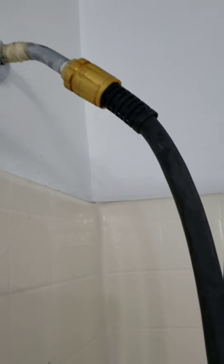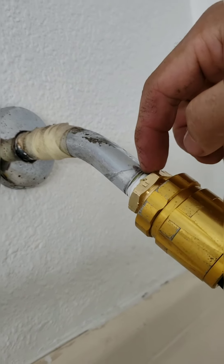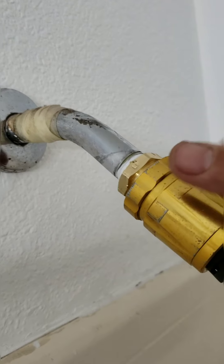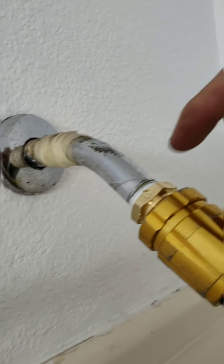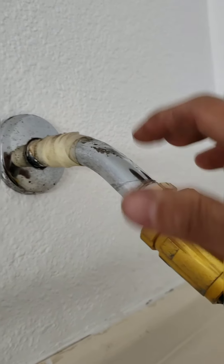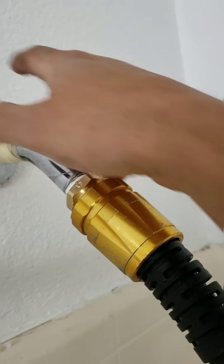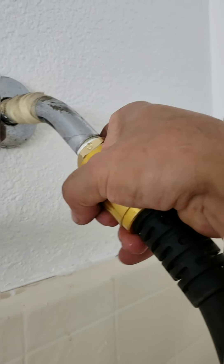This is option number two. You could put this inlet, which is a 1/2 inch female with 3/4 garden hose male — they sell that at any hardware store. If you don't want to have the diverter permanently installed, you could just put this instead. If you're like me and bathe the dogs only a few times a year and have no problem putting this on and taking it off, great. Just be very careful when tightening — hold the pipe for support, because the last thing you want to do is break the copper tubing or galvanized piping in the back. Even when tightening, hold this piece right here and give it some support.